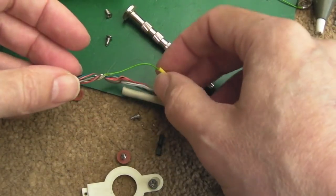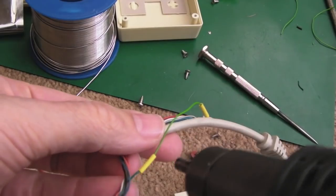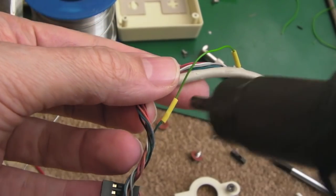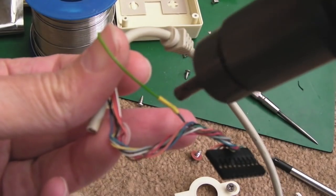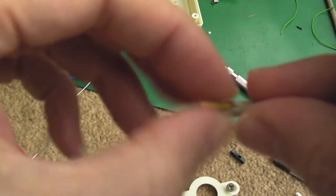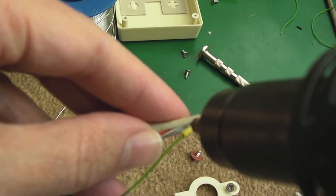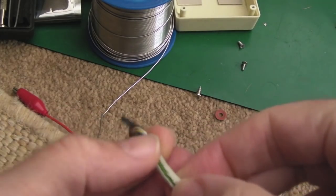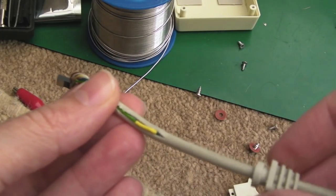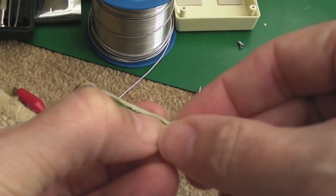It's quite large and exposed there so it is a good idea to slide this up over that and shrink. Around 100 degrees now, we'll just carefully heat that up. Yeah, you can see it's shrinking already. It's not going anywhere. And we'll just slide this down a little bit to make sure it's quite low in there - I want it as far in as it will go. And we'll just do the same with that, heat that up and shrink it. Although we fixed it here, some of the other wires could be a bit worn at this point.